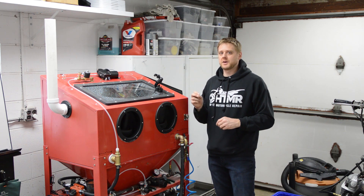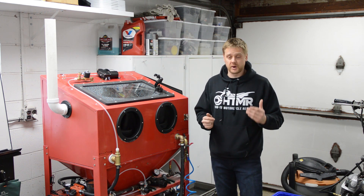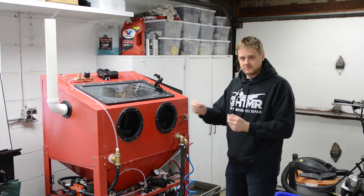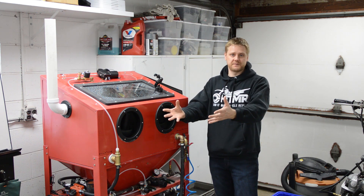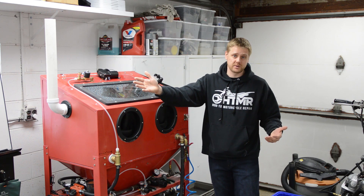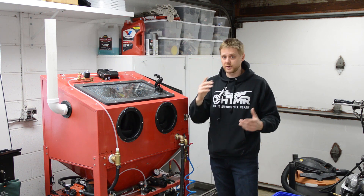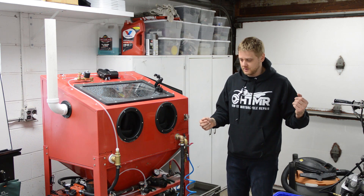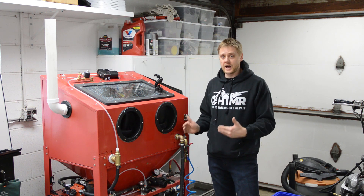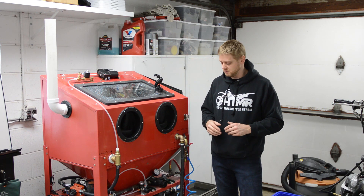You might think you heat the water up, the heater stops running, and life is good — but not exactly. When you're blasting, you have all this CFM coming out and it dissipates the heat out of the water very quickly, especially if your garage has been at 45 degrees. Your 80-gallon tank is full of 45-degree air, and that compressed air when it's released just cools the water like crazy. So you actually need a lot of wattage to maintain a really high temperature.